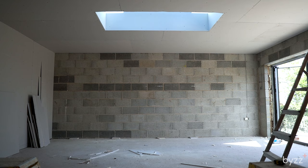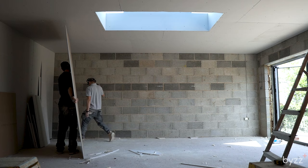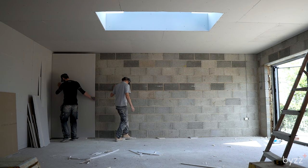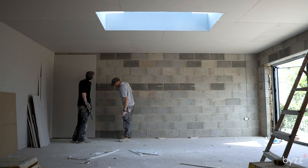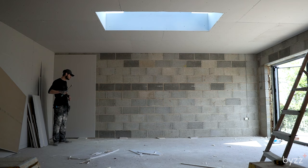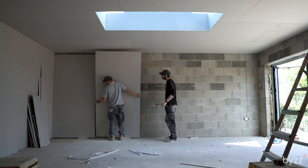Cutting - it is pretty much what it sounds like: cutting the plasterboard to make it fit. Usually a wall is slightly shorter than 2400mm but on this particular wall it was just over, which helps in a way but creates a problem down the line. Starting from left to right, we're using the stud wall to the left as our level because we know that's level, so we can push the board right up to that. Then we just start lifting the full 8x4 sheets into place, dropping them down onto the packers. We keep the packer to the right-hand side of the board so it causes it to lean left, resting on the board next to it.